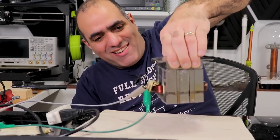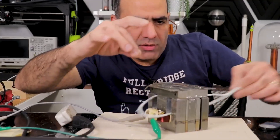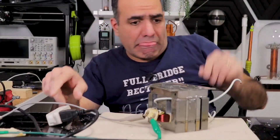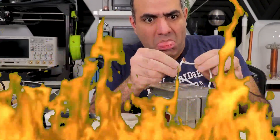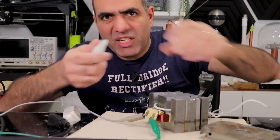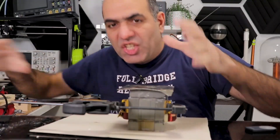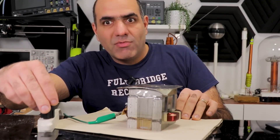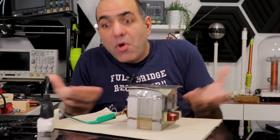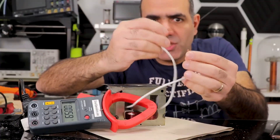This is a strong magnet. Now what happens if we run a single turn of wire through the transformer? Okay. Now what happens if we short the output? My wires are smoking. It's too noisy, let me crazy glue all these plates back together. Okay, the whole thing is glued together. Let's power it up. So quiet now — good gluing helps! Let's see how many million amps we'll get shorting our single turn.